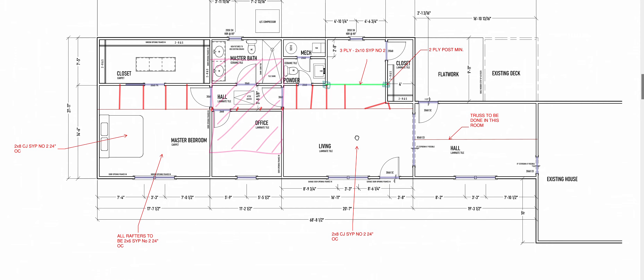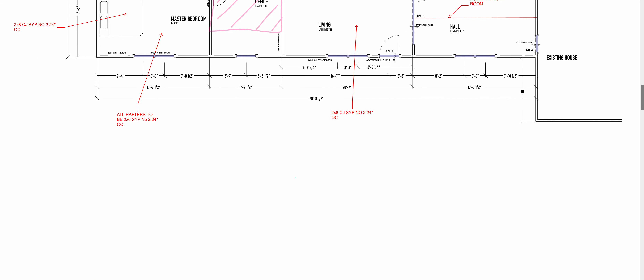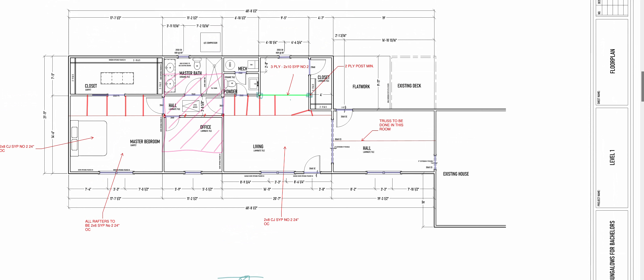So if there was a second story, we'd take that point in the house, copy it over to wherever the second story is, and drop that little post marker — make it a different shape, like a circle, to symbolize something else. So you've got your wall and you've got this circle marker. This is telling you that there was a post upstairs carrying weight. We've got to make sure that we put a post in the floor system and in the wall below the floor system, all the way down to the foundation. Make sure those markers are in there so you don't forget those little things.